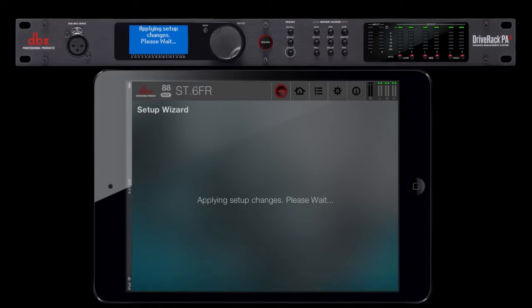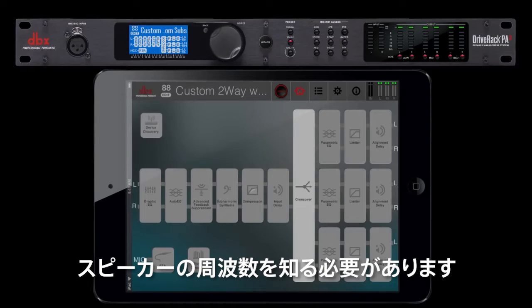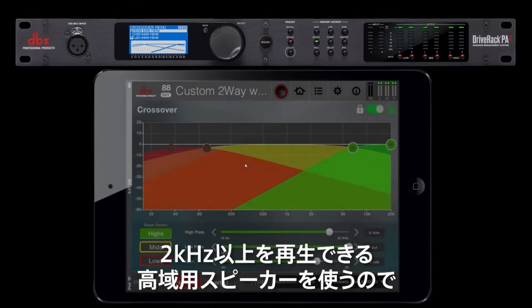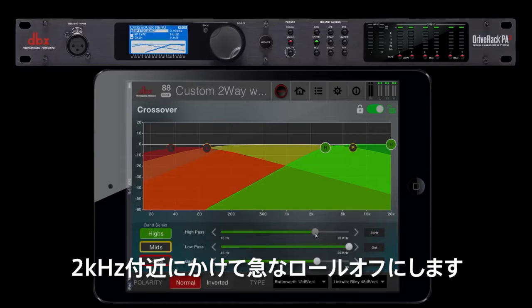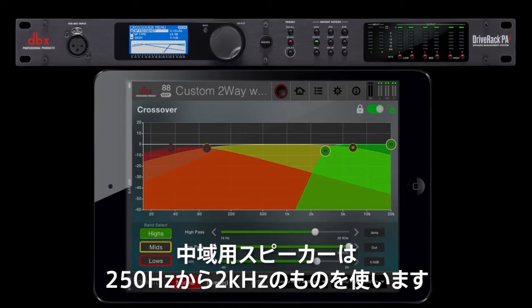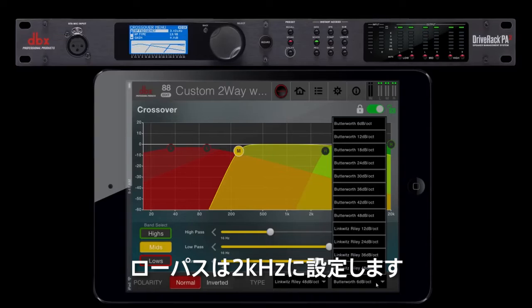Select yes to apply the changes. Press the back button twice to see the configuration you've just made. In order to set the crossover correctly for each speaker, you'll need to know what frequencies your speakers can reproduce — this can usually be found in the spec sheet. We're using high speakers that reproduce frequencies 2 kHz and above, so we're going to set the high-pass frequency for the high driver to 3 kHz, with a steep roll-off down to around 2 kHz. Our mid speakers reproduce frequencies from 250 Hz to 2 kHz; we'll set the mid high-pass frequency to 250 Hz and the low-pass frequency to 2 kHz.